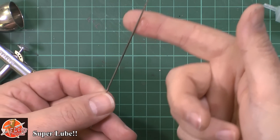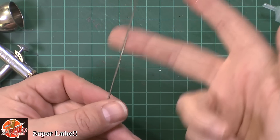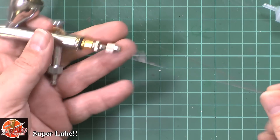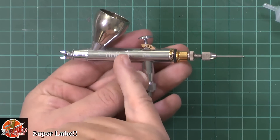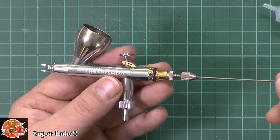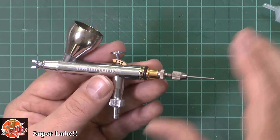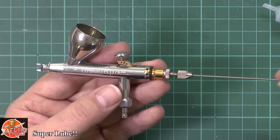Just down there — so you've fully coated the needle right the way through. Then get another finger and just wipe around; there's enough left on there to do the business. It's completely lubricated, and then the standard way, you just slide it back in. You will notice how, when you get to this midsection where the seal set is, where you once felt a little bit of resistance, this now just slides in and out of there no problem whatsoever. What you've actually done is lubricate that seal set — it doesn't matter if it's a rubber O-ring or a Teflon seal; it's just done it absolutely fantastic.